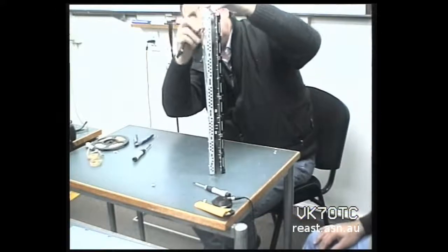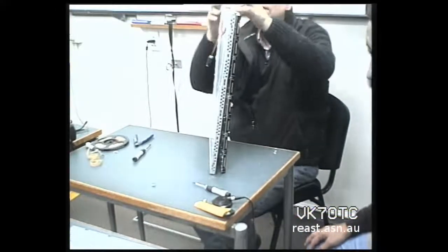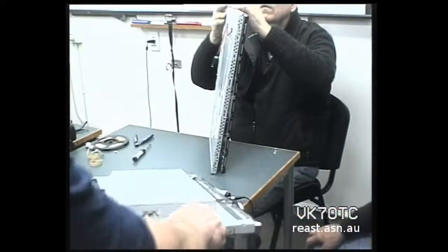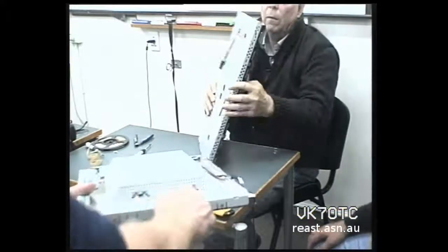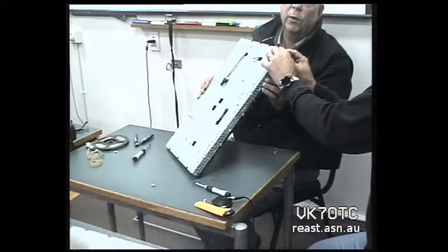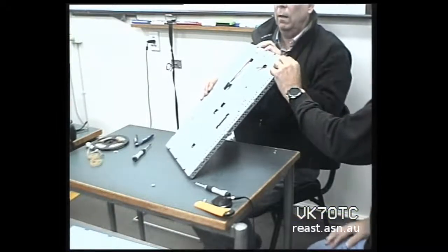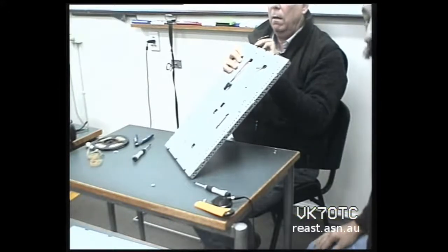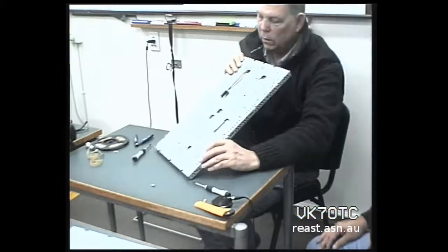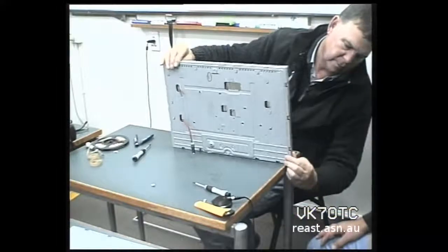That's where the compact fluorescent wires came through originally. And you can see on here, this one's got two compact fluorescent tubes, because there's actually two high voltage connections. So you might want to channel those so they don't get cut. Yeah, that's what happened the last time. A couple hundred volts, and then 400 volts at least. So it's just one.